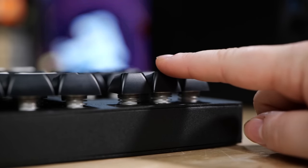But this kind of thing is good for your mechanical keyboard connection, and just a good old $5 40 megabit USB cable, 40 megabits, all you need for a keyboard. You don't type that fast anyway. If you were gonna use USB-C, because you wanted to use USB-C to say that you used USB-C, at least recess the connector in the thing much farther than this. At least another centimeter, all the way back in there. And give it some mechanical support on the sides. Have something that grabs a hold of it on the top and bottom and sides.